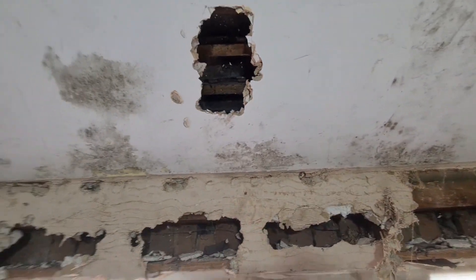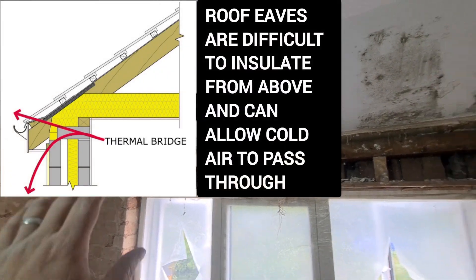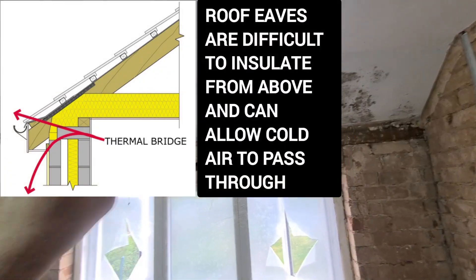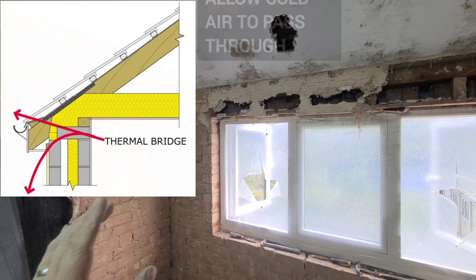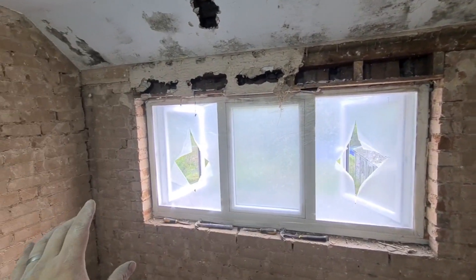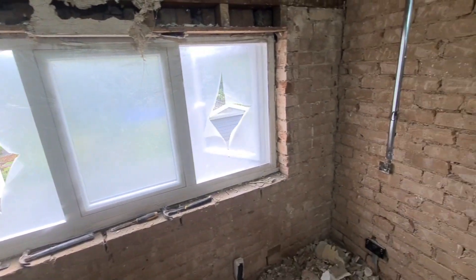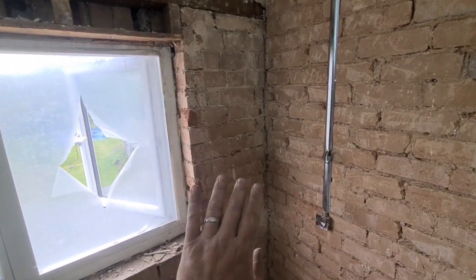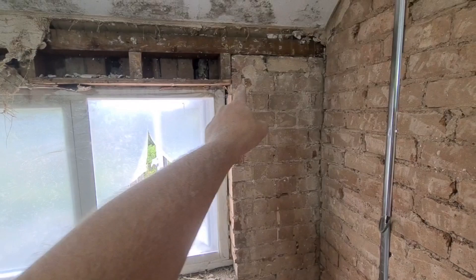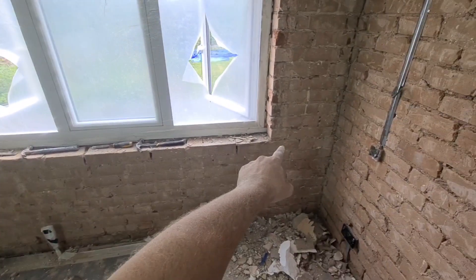Inside the cavity there between the tile and the plasterboard, so we'll strip out and insulate in between. We're going to fully insulate the brick wall here — the 9-inch solid wall, the outside facing wall — with a 25mm PIR-backed plasterboard that's going to go on here.